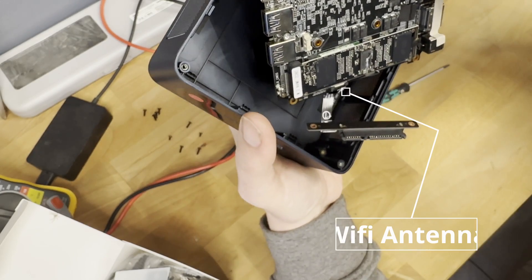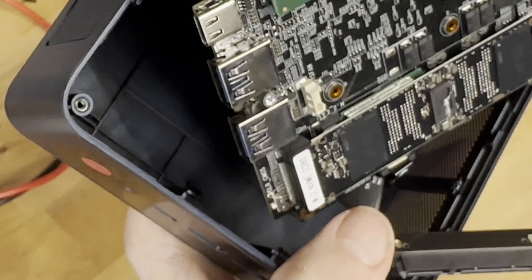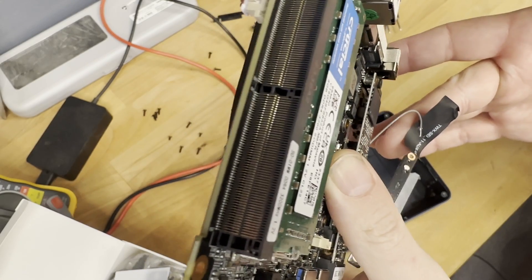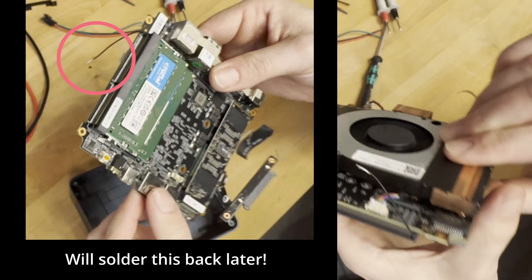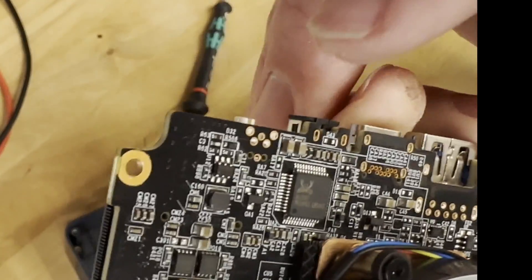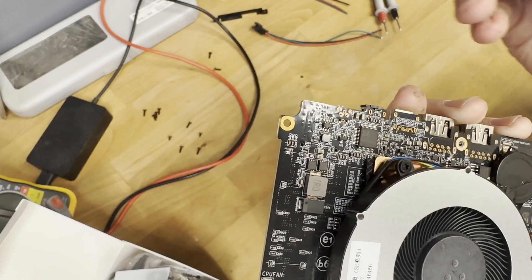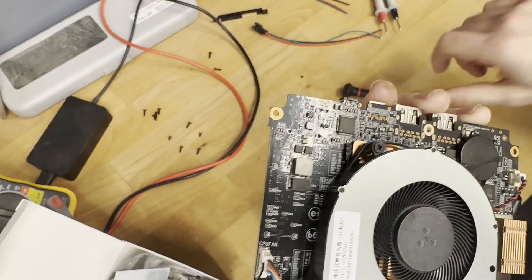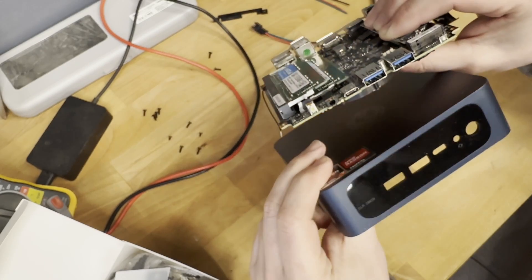There is the small wireless antenna — it's right here, it's a sticker. Now let's find the power on/off switch — it's this switch right here. Let's see if we can find an easy way to solder wires on it, and in this case it is not easy at all as these connectors are really, really tiny. But we will be okay. Sometimes you are lucky and there are just two big solder blobs and it's super easy, but we are going to solder it — we don't need a micro soldering iron, just a normal soldering iron.